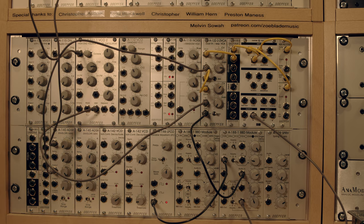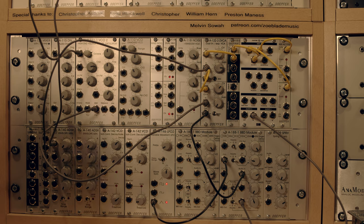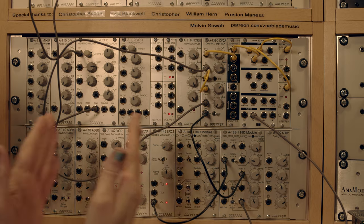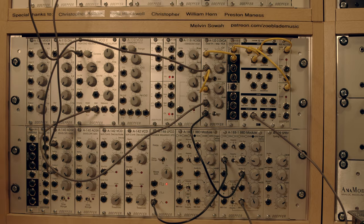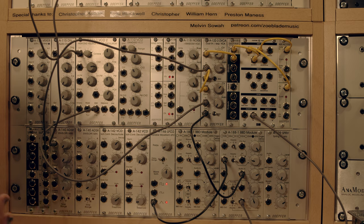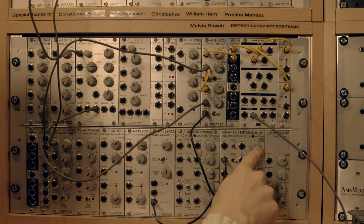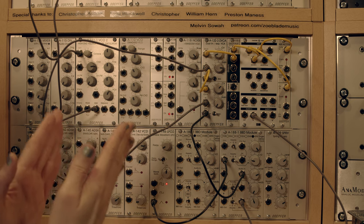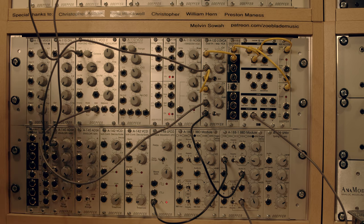You may also notice that this sounds a suspicious amount like pulse width modulation, which is because pulse width modulation, with its pulse wave that changes length, changes the width of it, is actually the same kind of thing as two sawtooth waves at a very slightly different pitch playing at the same time. And when we're changing the delay time, it's the same kind of thing as changing the pulse width, which is the same kind of thing as changing how far apart in tuning the two sawtooth waves are, which is how you can sort of make a pulse width wave, which again, you don't need to know anything about any of that,